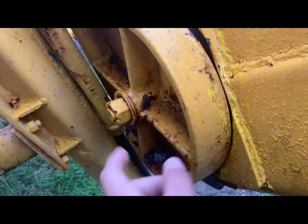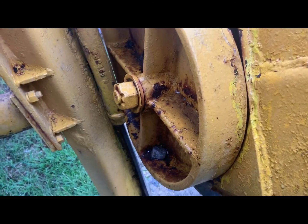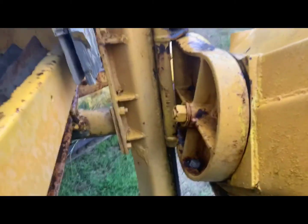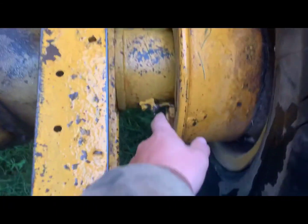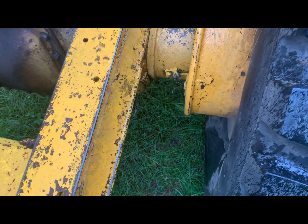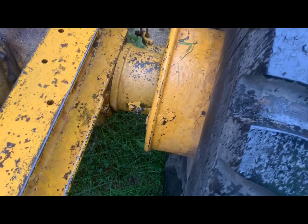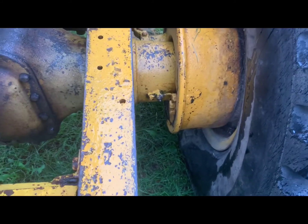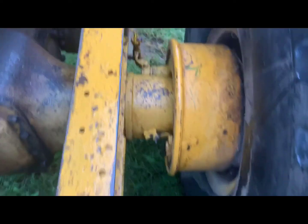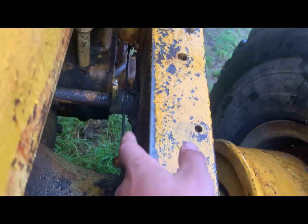Make sure the arm is tight — I'll have to tighten that bolt eventually. There are grease zerks back here; I believe it's every 120 hours, about two pumps or so. Grease one right there sparingly — maybe every 300 hours. Then there are grease zerks on the other side as well — pump those until grease starts coming out the sides.